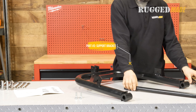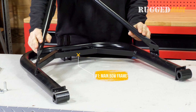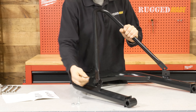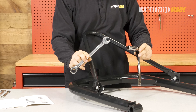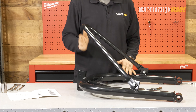Start by mounting the support bracket to the main bow frame. There are two tabs welded to the bow frame. Use two M10x25 bolts and locking nuts. They're welded at an angle so that when you mount the support bracket it will stand off at approximately a 45 degree angle. The bolt and the nut both take a 17 millimeter wrench. The support bracket should mount to the outside of the tabs.